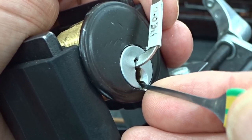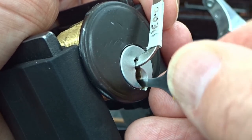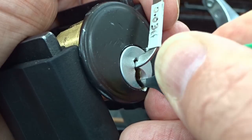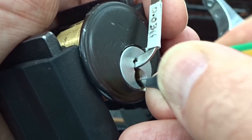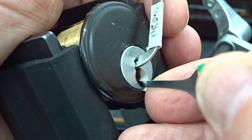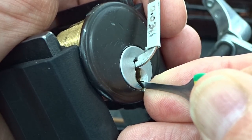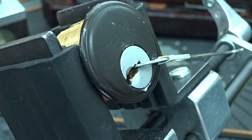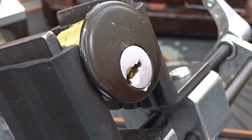I've got a good false set, looking for any feedback to tell me who's next. I think one is set; I get nothing. On pin five there's a little counter rotation. Counter rotation but it's really solidly set, so I'm going to have to put some spectacular pressure on it. Counter rotation on three again - nice solid click but I'm still getting counter rotation on three. We've got multiple spool elements on a couple of these pins.